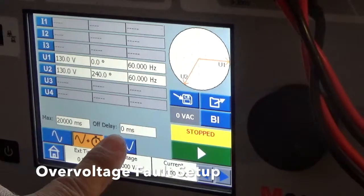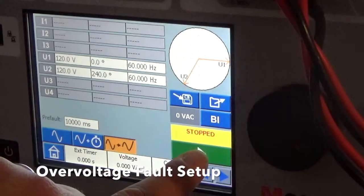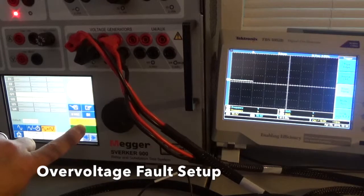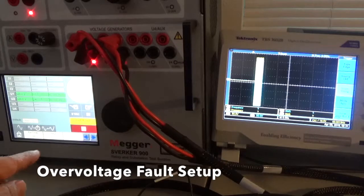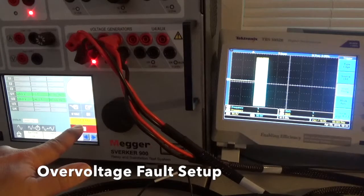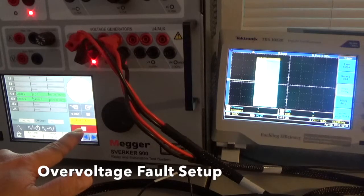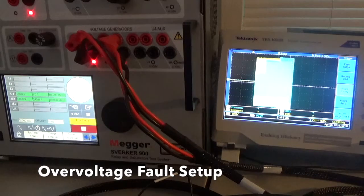Let's go to the menu that says we're ready to transition from Pre-Fault to Fault when we press Play. We're going to watch the scope change and the timer. See the scope change — 120 volts. The timer's counting down: 5, 4, 3, 2, 1 second. Down to — or up to — the Fault mode, 130 volts. You'll see the scope slightly change to the 130 volts.